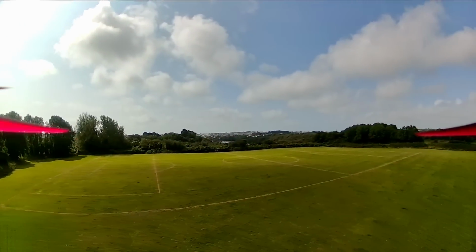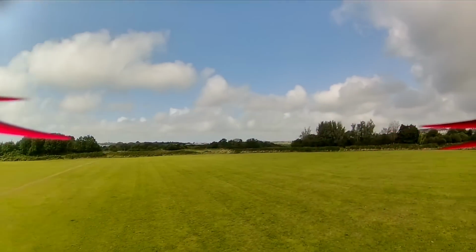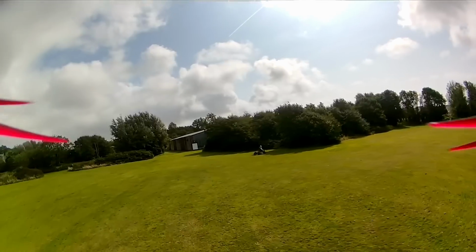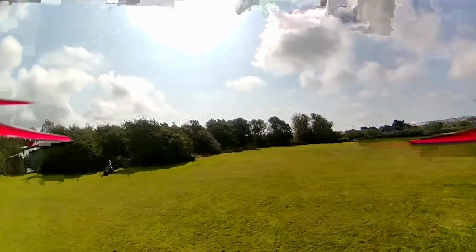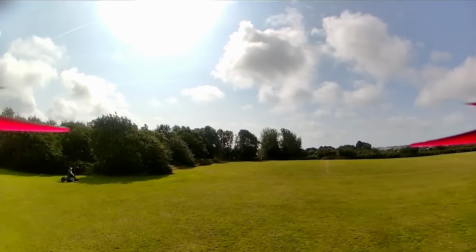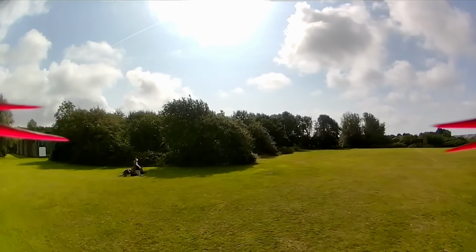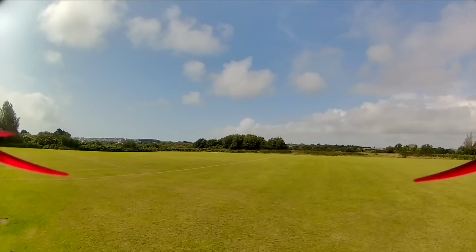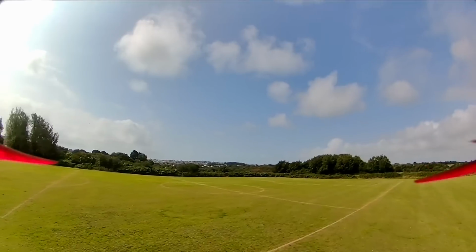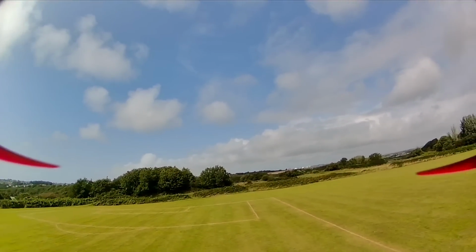Everything felt quite jerky, not smooth. I was also getting a lot of random breakup as well. And what is interesting is I was seeing more in the goggles than I am on the DVR footage, which would imply it may be related to processing as a result of me recording and viewing the live view at the same time. And it almost is as if it prioritizes the recording image over the live view. I need to do more testing whilst not recording.